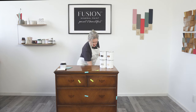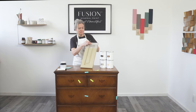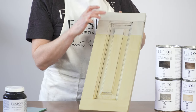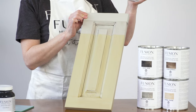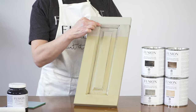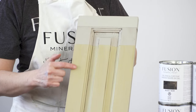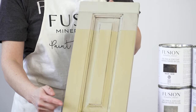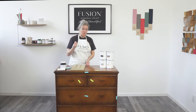Just for an example, I wanted to show you a couple of pieces. This one we painted a couple of years ago. This is putty, and then I used the double espresso gel stain mixed half and half with odorless mineral spirits to give me something very thin, which I used as an antiquing medium for this. Then I put on the top coat, which was pretty thin. You can see how much it has yellowed over time, and that's something you do need to expect with an oil base.